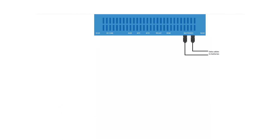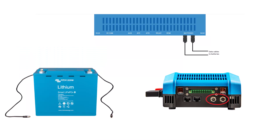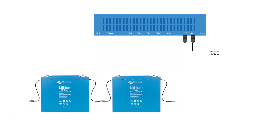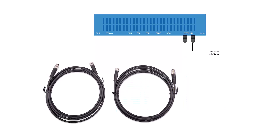The first connections are the data cables that go to the batteries. There are two terminals on the BMS and each battery has two connections — both wires connect to the BMS. If you have more than one battery, the cable daisy chains from one battery to the next and both ends of the chain come back to the BMS. They're almost certainly not going to reach, so you will need extension cables.